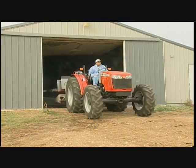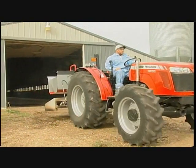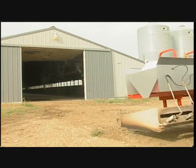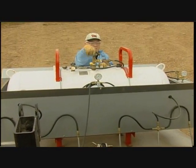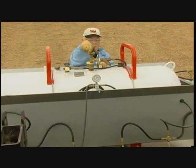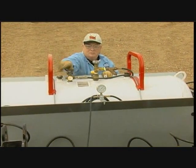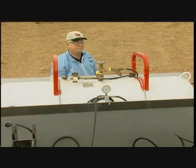The PHS portion of the treatment is completed, and the unit is running on the pilot setting. Once outside and stopped, lower the unit to the ground. The unit is in the pilot setting. Proceed carefully to the tank and shut off the liquid and vapor valves. The unit will stop after the lines have been emptied. Be aware that this unit will be hot for an extended period of time.